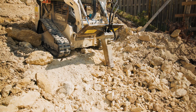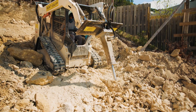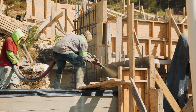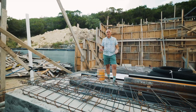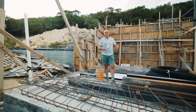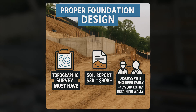If you are building in parts of America where the ground is soft, where there is no bedrock or limestone, most likely your engineer won't even start working on the foundation without a soil report, because different soils interact with the foundation in different ways. When there is a lot of erosion, you definitely need to think about how you will protect your foundation from water flow and pressure. That's why the soil report is the second most important thing in the design process.